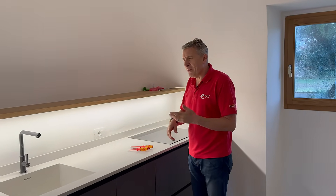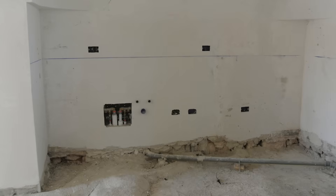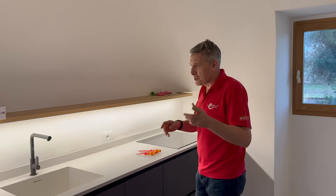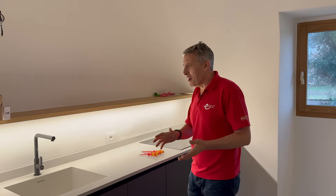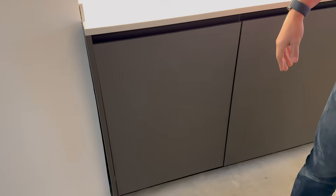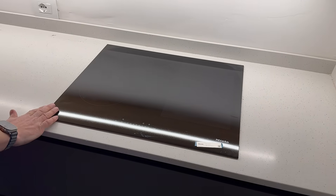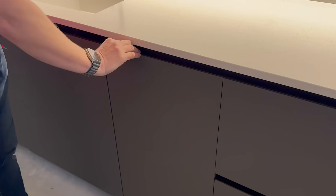The Italians might have a fetish when it comes to flexible conduit, but there are two fetishes we have in the UK. The first is sockets — there are only three on this bench to power everything; we'd have at least four or five doubles with their own switch. The second fetish is isolators — we put isolators on absolutely everything. Underneath the counter there's a fridge, a dishwasher, and an induction hob. In the UK we'd have at least three isolators. Here in Italy, there'll probably just be a socket underneath the bench where they're plugged in.